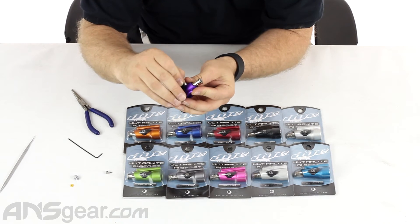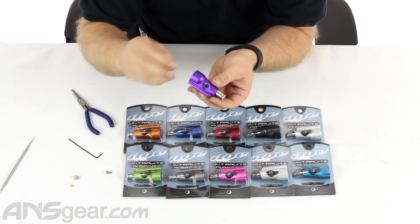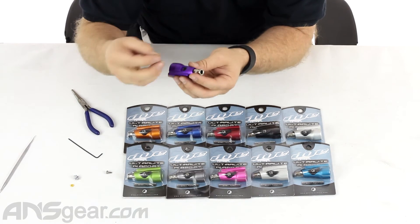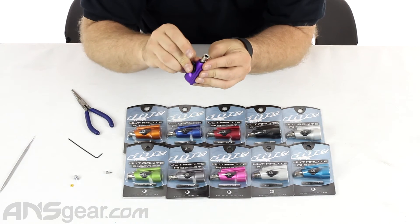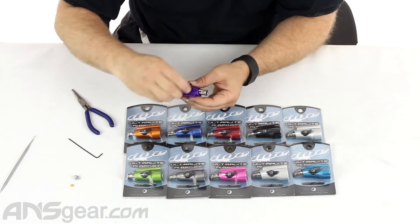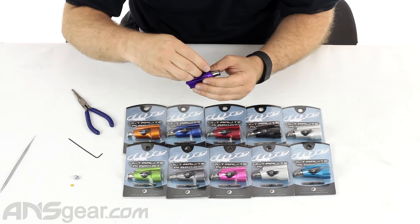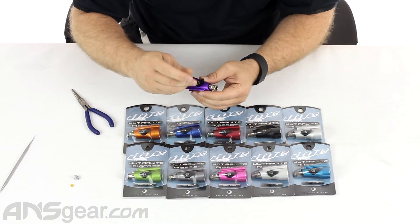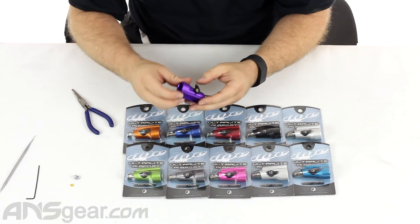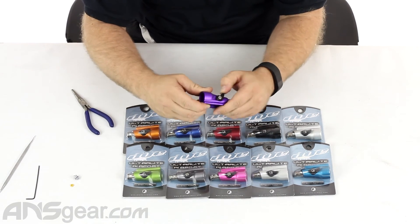Then we can hook up our lever to it. The lever can go one of two ways. If you put it in the index improperly it wouldn't work — it wouldn't activate properly. So if you put it together and you find that your lever is not working, just take it off and flip it around. Let's put that back on there, and then I can put my screw back in. Let's tighten that down — just snug it up nice and tight, don't overly do it. So now we always want to work with the cam in the off position when we're putting this core back inside, because we don't want the post to be poking out as we're trying to screw it down in.